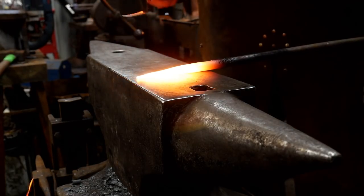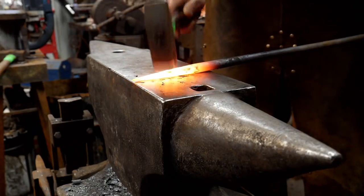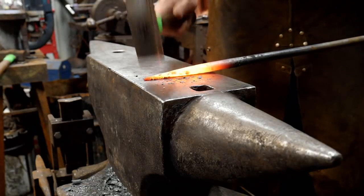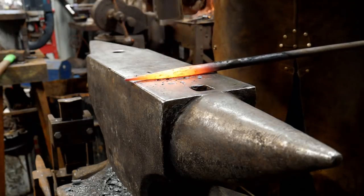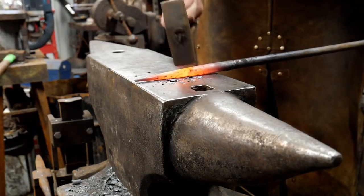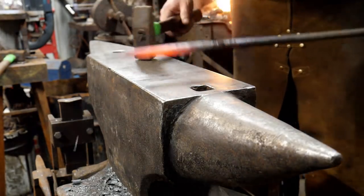Now I took what was 8 sides and to the best of my ability I'm going to try to make it 16 sides. This is a dinner bell so I'm not worrying too heavily about it — it just needs to be reasonably round. In fact, I like there to be a resemblance that I did some forging on it. I like to remove as many hammer marks as possible for clean forging, but I do like there to be a sense that there was some sort of material change in the cross section.